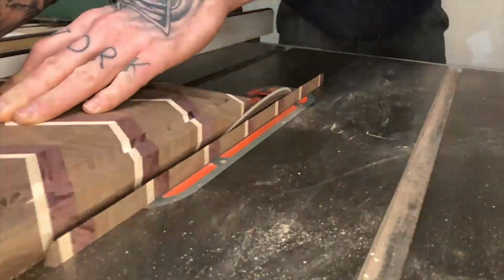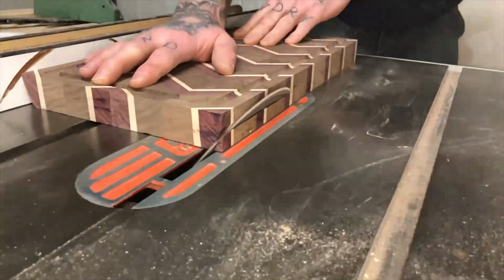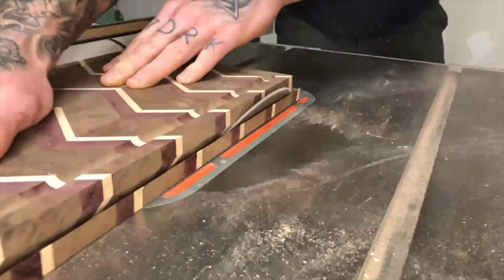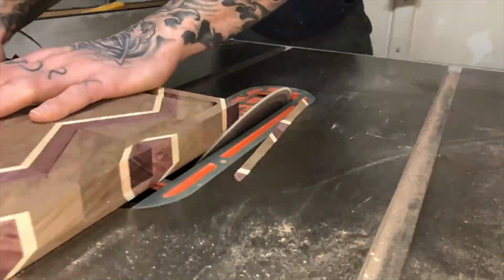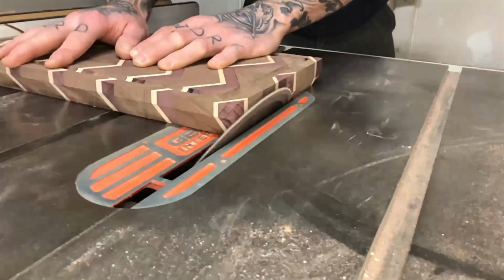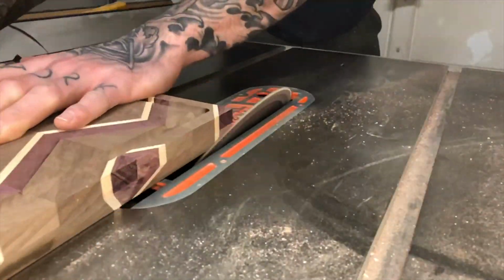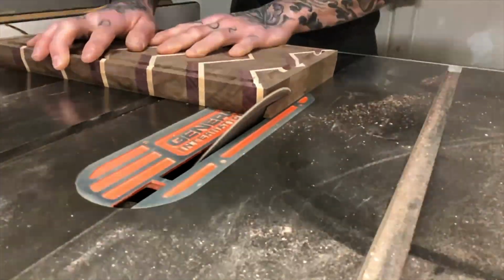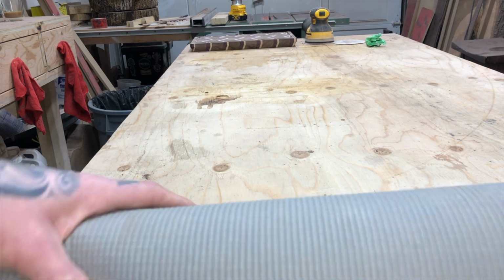This gives it a nice shape, and it also doubles as a good spot to get your fingers underneath to pick it up off the counter. I make the first 2 cuts along the length of the cutting board, then I reset my saw and make the other 2 cuts along the width. When making the last 2 cuts, I don't want to take off too much, so I made a few passes to make sure that my corners lined up perfectly. You can always take off more, but you can't add it back.